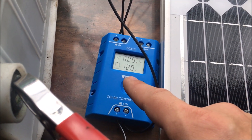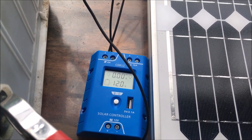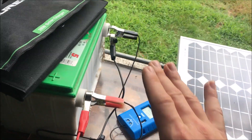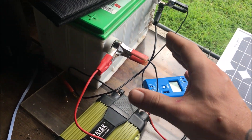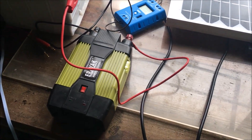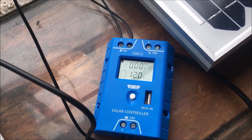We are showing an indicator that it is charging and we're at 12.0 volts. I'm going to connect both solar panels together and see if we get anything. Still no sun out, but with both panels connected, it does show that it's charging. This is all very temporary — ideally I'll get threading screws to mount these properly. Turning the AC/DC converter on now — we're still sitting at 12 volts.